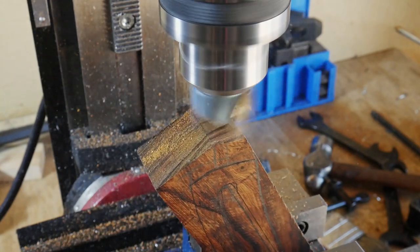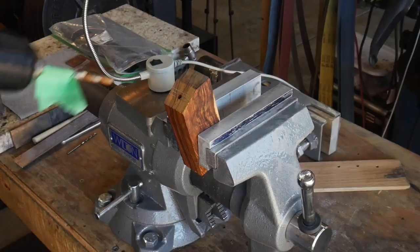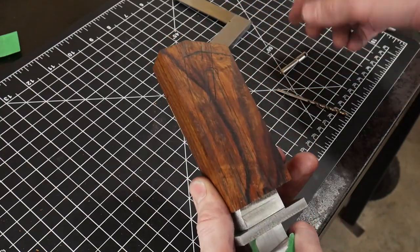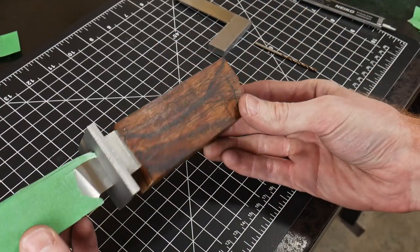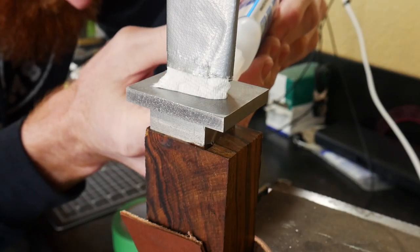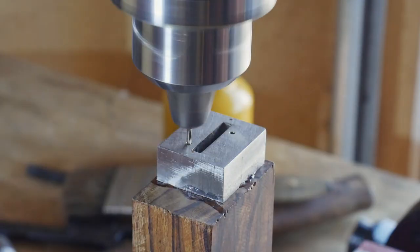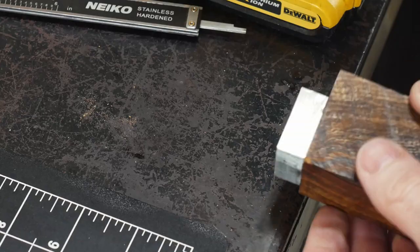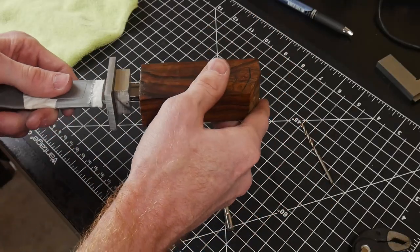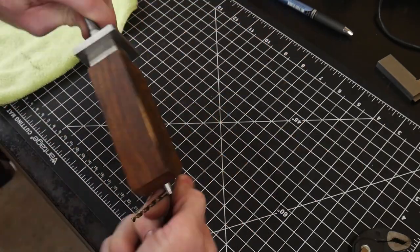Using the router bit on my mini mill I flattened the pommel area of this block, then drilled a through hole to connect to my slot in the wood. Originally I was not going to add a stainless steel pommel and was just going to seat my finial into the wood block, but due to a small gap around the OD of my finial I ended up abandoning that idea and adding a stainless steel pommel. To get my locator pins to pass through the spacer, guard, and into the handle material I used the spacer as a drill guide, super glued it to the wood, and drilled into the handle material to accept my hardened dowel pins.